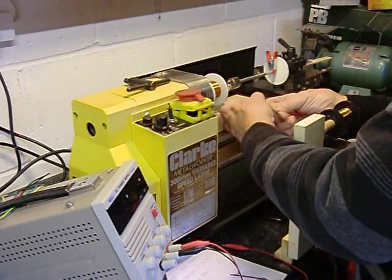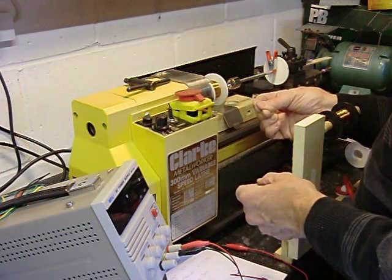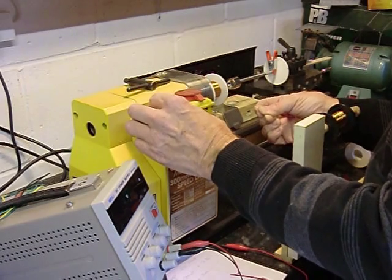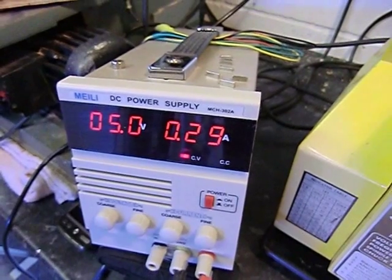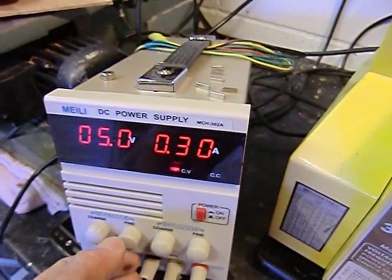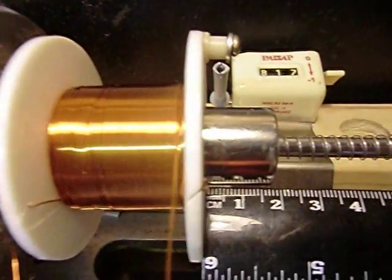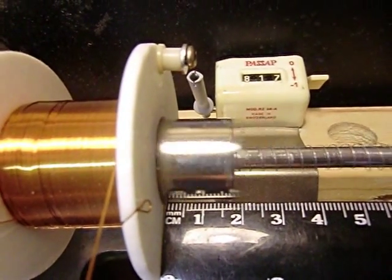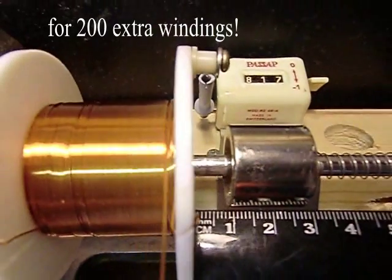What I'm doing now is deliberately overwinding the coil to see what effect resistance has on the ampere turns and the effect of the magnetism. Now I've got 817 turns on there, applying exactly 5 volts, measuring 300 milliamps. When I apply the power, the magnet moves just about 9 millimetres — the same as last time. So very little improvement for an extra 200 windings or so.